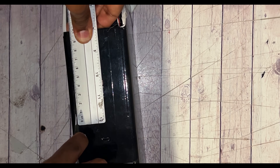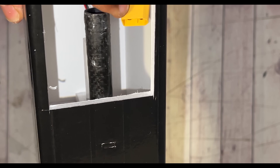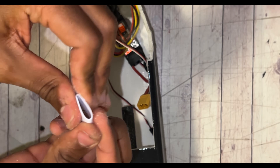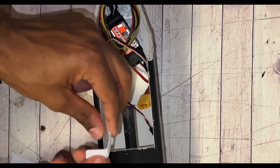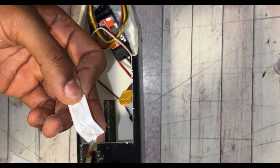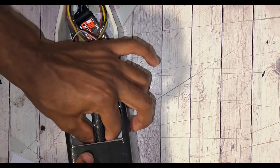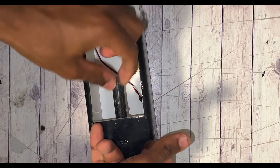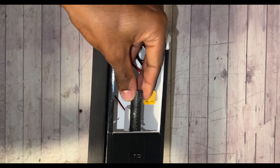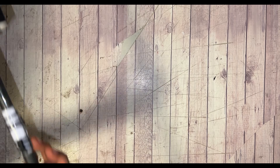In this fragment you can see me cutting out room for the electronics, mainly to glue plastic cards for the boom at the very front. I bend a small piece of plastic card into an L shape and glue it between the upper inner part of the fuselage and the boom itself, done on both the left and right sides. After the glue hardened, I tested the structural integrity and the boom doesn't move anymore — it is one with the fuselage and extremely solid.